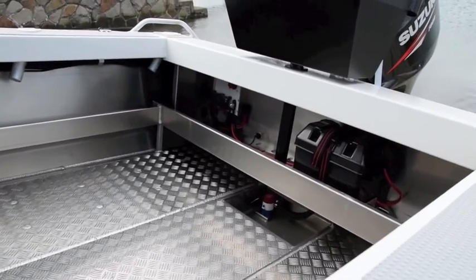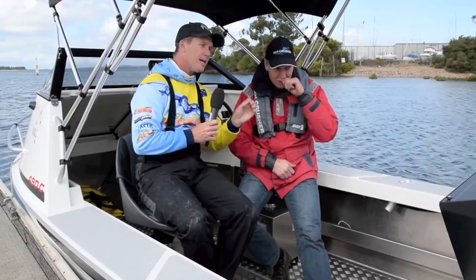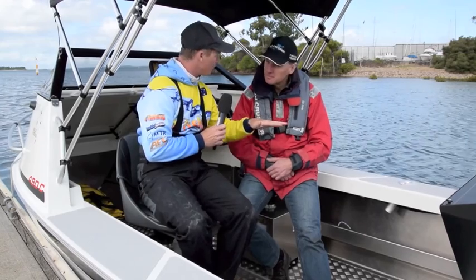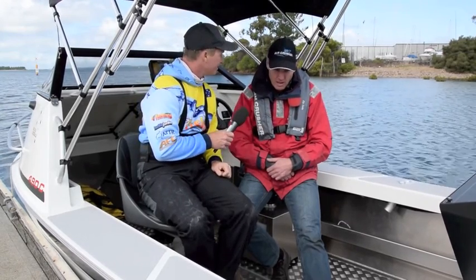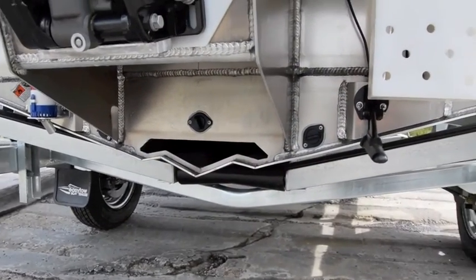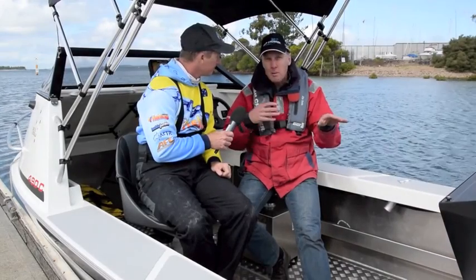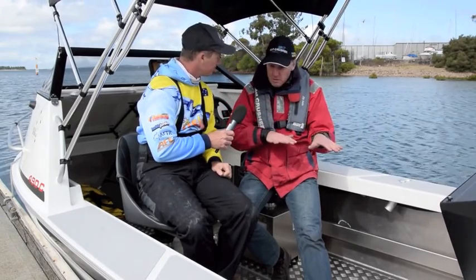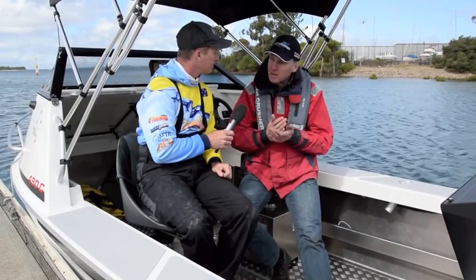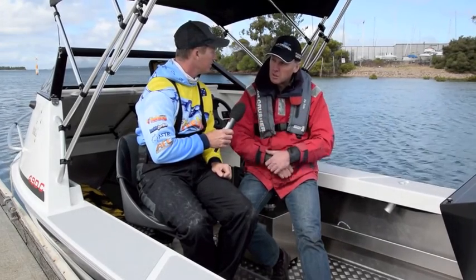This one seems like a lure caster's boat and the other more like a bait fisherman's boat, and they've been set up that way. On the water ballast feature — for someone moving up from a standard tinny — the water ballast system has a tunnel up the middle of the boat with an opening under the hull at the back. When the boat stops, water trickles in passively — it's not pumped — which drops the boat down on its chines, giving greater stability. This allows a deeper V hull, so when running in windy conditions you get a smooth ride, and when stopped you have a stable fishing platform.